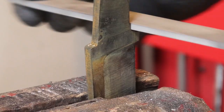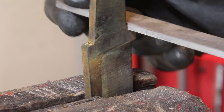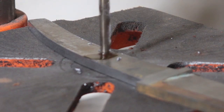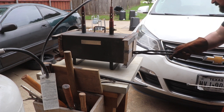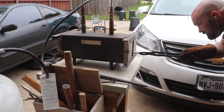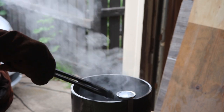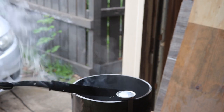Here I'm putting in the bevel and I find a big, nasty delamination — that is a disgusting-looking delamination. I really didn't want to quench with any of that left, but I also didn't want to grind the blade all the way down before I quench because it would warp. So after I drilled the hole — which took like 10 minutes to get that steel soft enough — I decided to go ahead and quench with just the tail end of that delamination still present in the blade, which was risky. It could definitely open up further in the quench, and I believe it actually did open up a little bit further, but I was able to take care of it in the end.